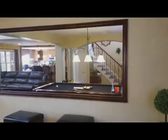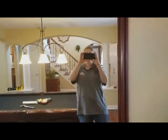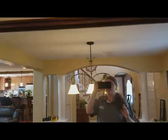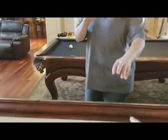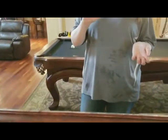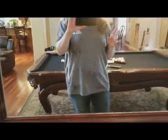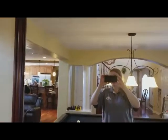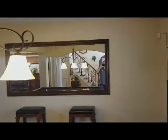All four sides are up. I went back with my stain brush and covered spots where stain got knocked off or needed to be filled in. The trim pieces are still drying because when I was testing it earlier, I discovered that when you put the small pieces of trim up against the mirror you can see the back of them reflecting in the mirror. The problem was I could see I hadn't stained the back fully, so I went ahead and stained the back of those trim pieces. That's a really good tip: stain the back of any pieces that butt up against a mirror so you don't see the ugly unstained backside.